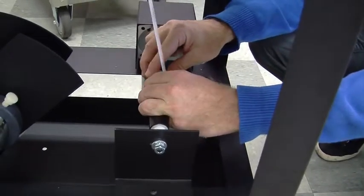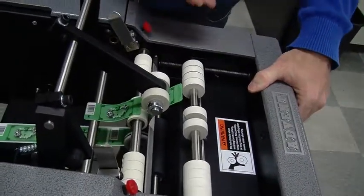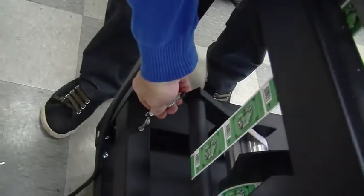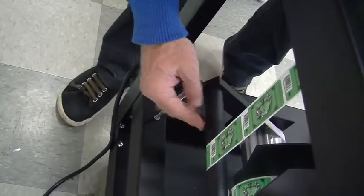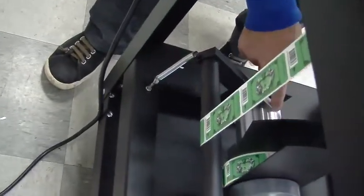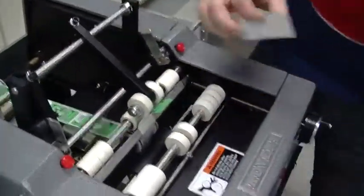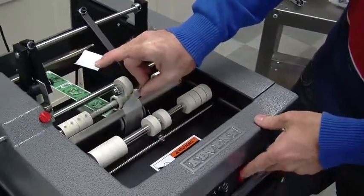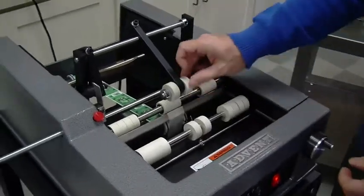as you can see here. Now if I were to go ahead and turn on the machine, you would see labels probably start popping out, just like that. Why that happened is because I didn't reattach the brake arm spring. And that's a common mistake. So make sure you reattach that. And what that does is that activates the white strap and will stop the mandrel from moving, from accelerating. And a good way of testing that is turn it on, grab the label. You can see it stops.